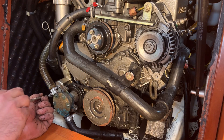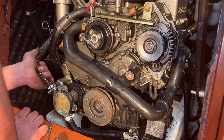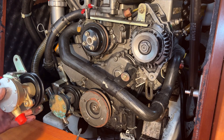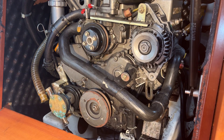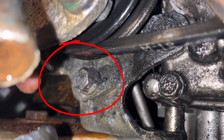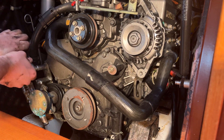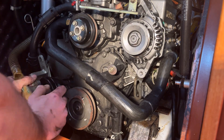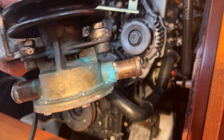Just going to disconnect the double hose clamp here — there'll probably be a bit of water that will come out but it'll drain down into the bilge. The new pump is there and it's identical, so you can see the adjustment to slacken it off is actually at the bottom, with a nut concealed underneath. Once we undo that we'll be able to push the belt all the way in to slacken it. There we go — one culprit leaking water pump. Look at the state of that — it needs a full refurb.